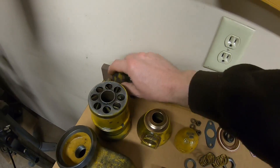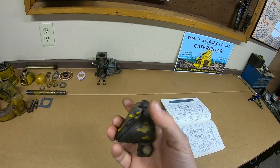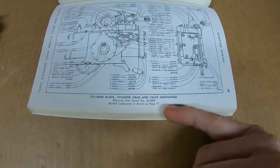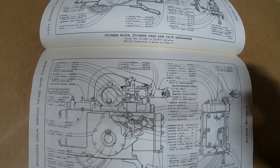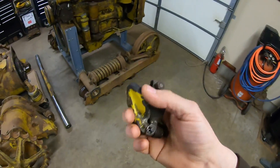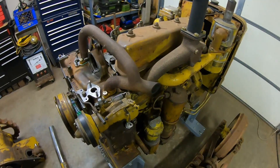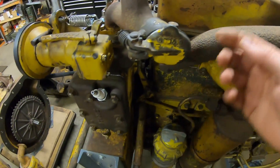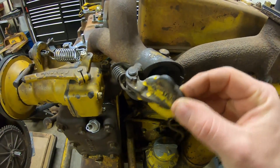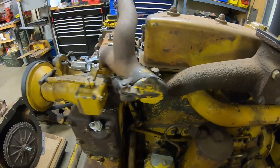That leads us to this interesting little piece back here. I don't usually do upgrades to first-generation stuff, but this one is so cool and so hard to find anymore that I just have to use it on this build. It didn't come into effect until serial number 5J1820 — there's an exhaust flapper on the end of that pipe; all tractors prior just had it wide open. It's functional too, keeping pests from crawling down the starting engine exhaust pipe when it's not in operation. It just clamps on the end of the pipe, and when the engine starts, exhaust pressure pops the cap open. There's a spring on the pivot that over-centers and holds itself open, and a little tab on the edge so you can close it back up again.